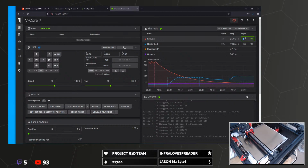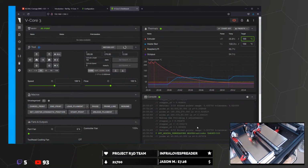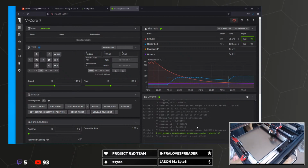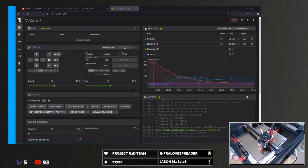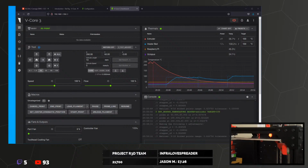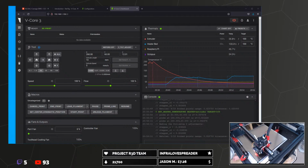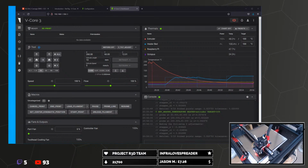Thermal expansion will matter. Well, obviously the XY expansion is not problematic on the machine because of the kinematic coupling, but that's not the only factor at play, unfortunately. If it was, our lives would be much easier. Because it has an effect in Z as well, we need to make sure that we account for that.